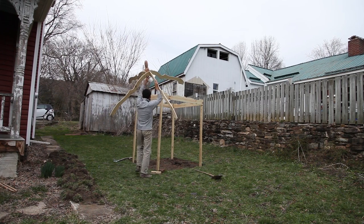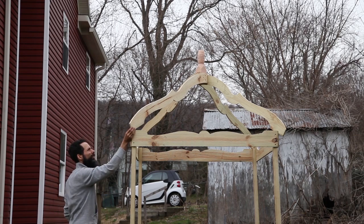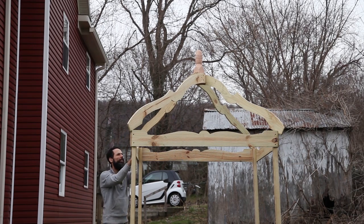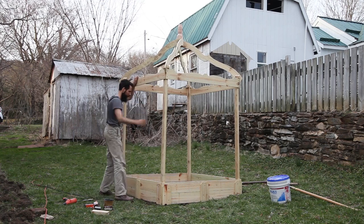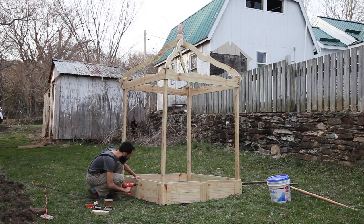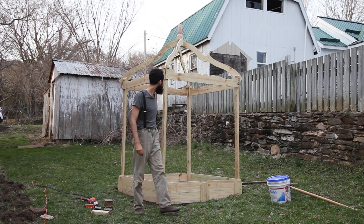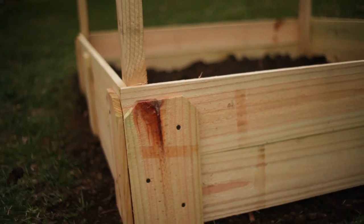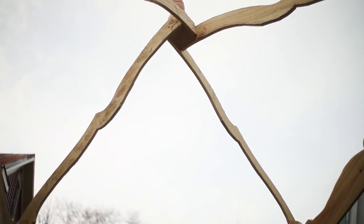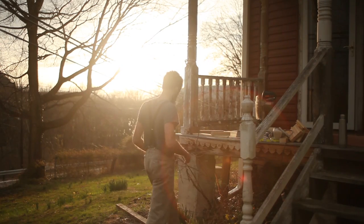All I had to do now was to install it on top of the structure. I cut out notches in the ends and fastened them with little blocks of wood to the corner posts, although later I found it easier to just use small metal L brackets. For the top finial, I used a piece of scrap 4x4 post I had turned in my mini lathe. You can buy one made for porches or fence posts from the hardware store, or repurpose an old furniture leg. I ended up putting two layers of boards in the bottom to make the bed deeper, and attached the off-cut fence pieces to the corners and center to add detail and structural stability. I was really happy with the results.